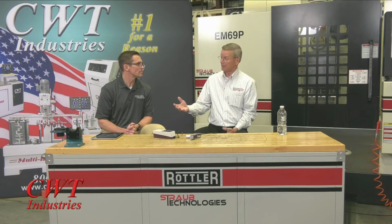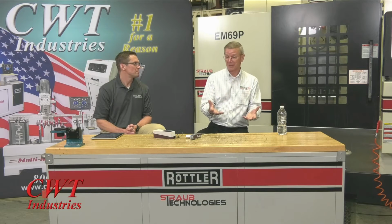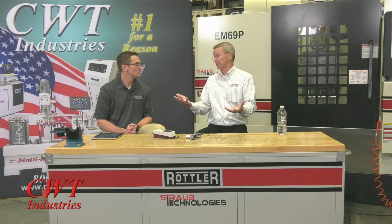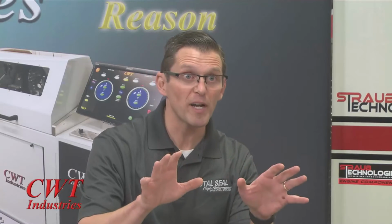So depending on the prior finish, in other words, the old finish, if you don't have the right abrasive grit, you could really do more damage than if you were to just put that new ring in that used Nicosil cylinder. I think that's probably the best advice, is that if you don't know, don't do anything. Yeah. Because Nicosil being chemically different than cast iron, it does require a completely different surface finish. And break-in process, things like that are very different with Nicosil than cast iron.